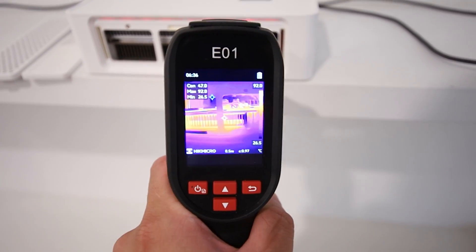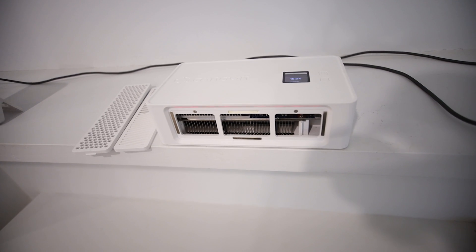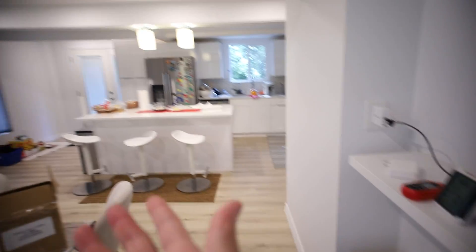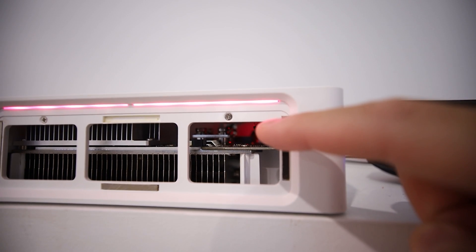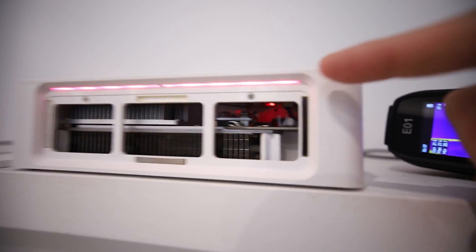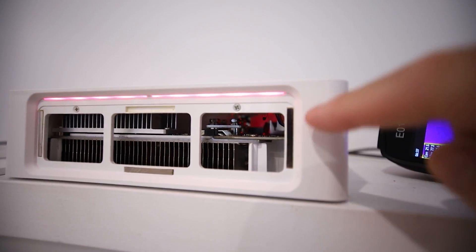That MOSFET is at 91 to 92 degrees Celsius. That little black square between the red lights — I believe that's the MOSFET. Over 90 degrees Celsius on that thing, I'm not sure how well it's going to do long term. I'm kind of worried about that little piece. There's definitely room to put a copper heat sink on top of it — I'll try that out in another video. Hopefully Canon watches this and can rectify that, because that part is running pretty hot.